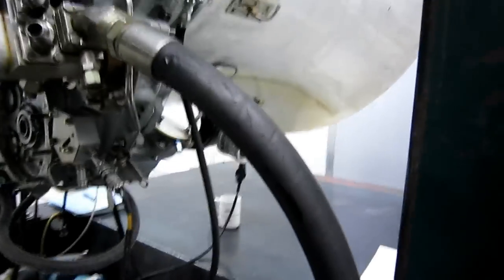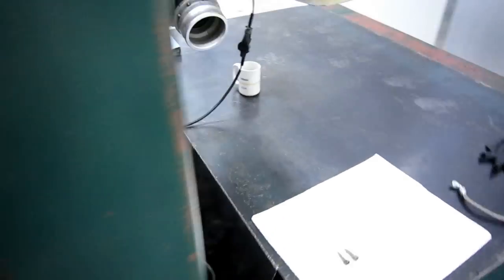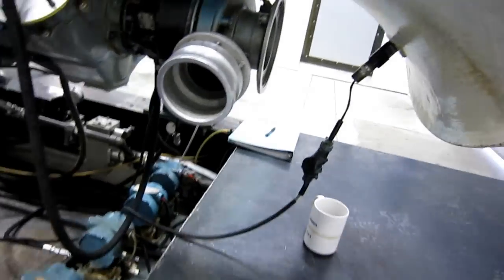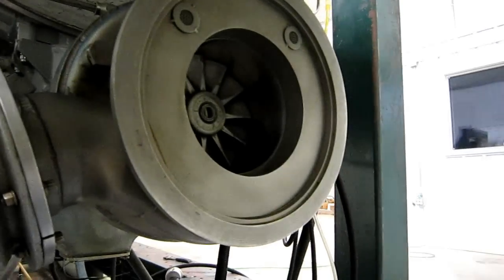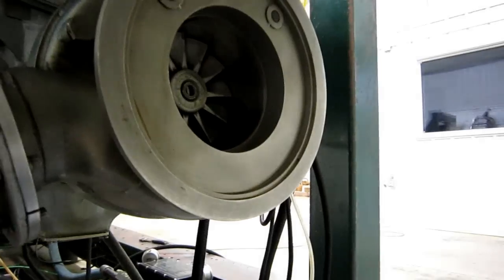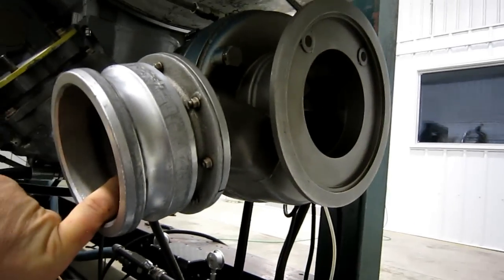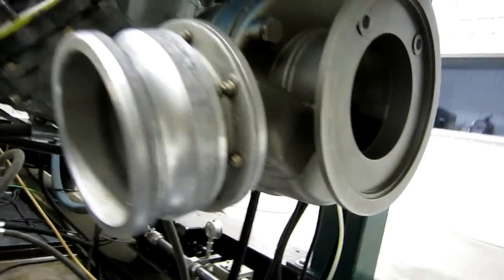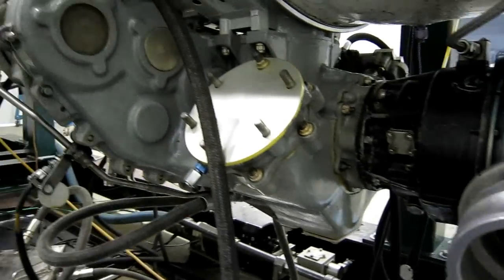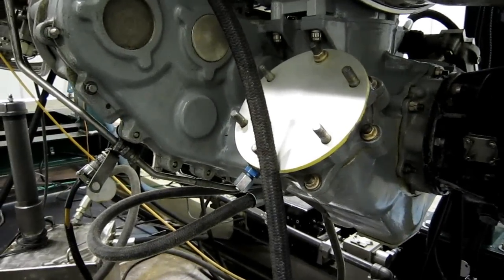The starter is over here — right there — and you can see that the air goes in here. That's the outlet of the starter, the air turbine, which uses the pressure of the air from the start cart to drive the gearbox of the LM1500 to start it.